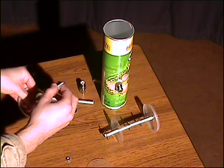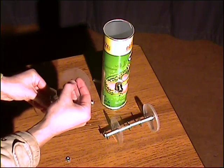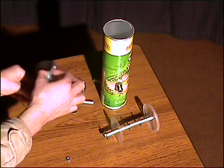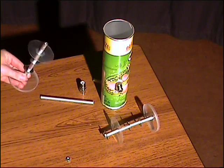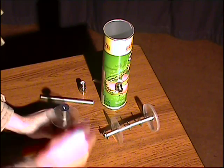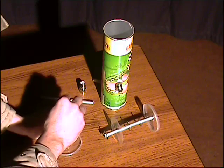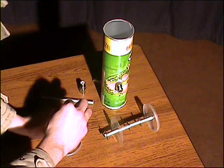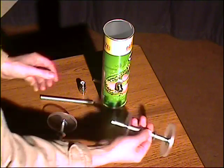When you get down to your last piece of tubing and your last washer, stick the plastic disc over the all-thread — which you've made another hole in — then put on the final washer, final piece of tubing, the last washer, and sandwich that in with the last lock nut so that you've constructed your front collector.